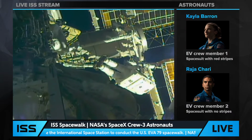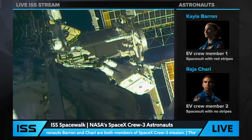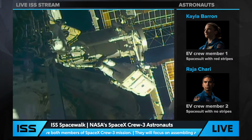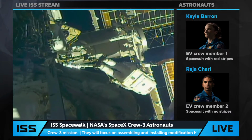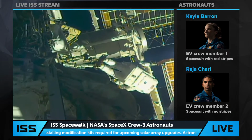Affirm. Okay. Take a breather, and when you're ready, we'll take those lower strut checks, the black line, the gap, and a wiggle test. Black line looks parallel and flush. No gap at the bearing. Wiggle test. I just heard wiggle test. Kayla, confirm a good wiggle test? Good wiggle test. Copy, good wiggle test. That's a good M19. Nice work there.